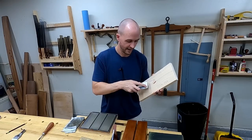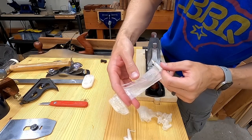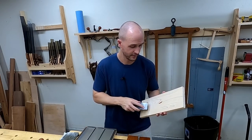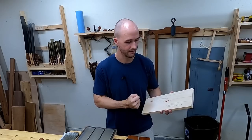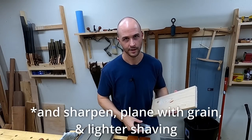Two: it makes it easier to push the plane through wood. If it's cambered you're taking the thickest shaving right in the center, slightly less on the outsides, so you're not removing quite as much wood. Some other things can make it difficult to push — such as going against the grain, and some woods are harder than others — but if you're having a problem where the wood is getting jammed and stuck, try cambering the blade a little bit.